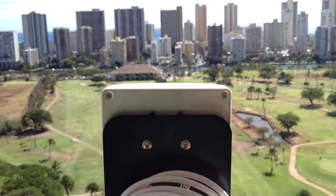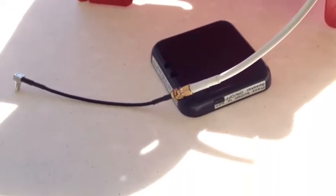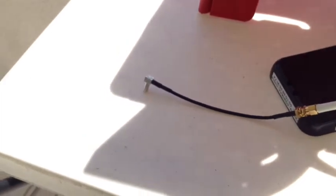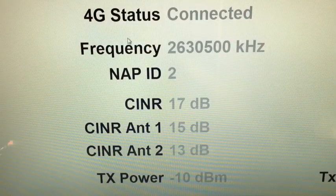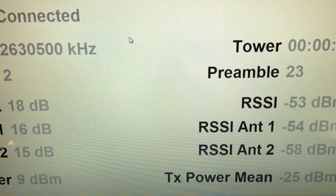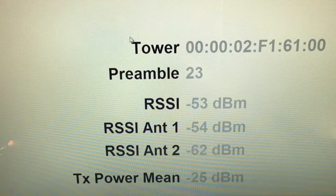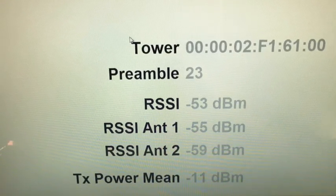So for our second antenna, this is the one that's a 10 dBi with a 5-meter cable, and this antenna is specifically tuned to 2.7 GHz. The cable is terminated with an RP SMA connector, again making it easy to connect to your Hub Express. For this test, we'll be using a Clear Spot Apollo with a pigtail adapter, which will allow us to hook up to that Clear Spot Apollo to either Antenna Port 1 or 2.